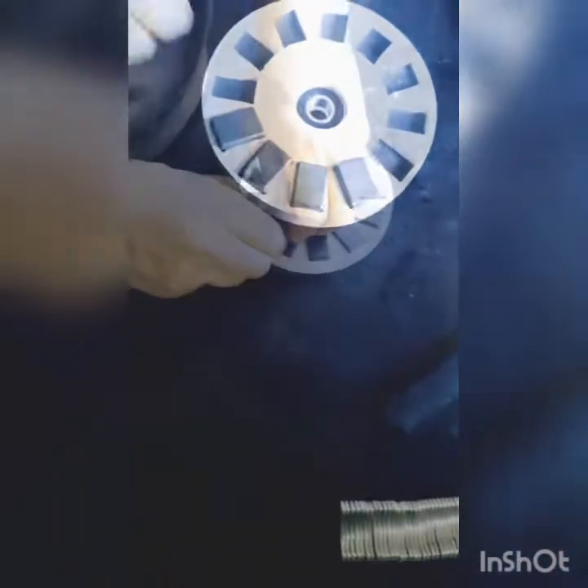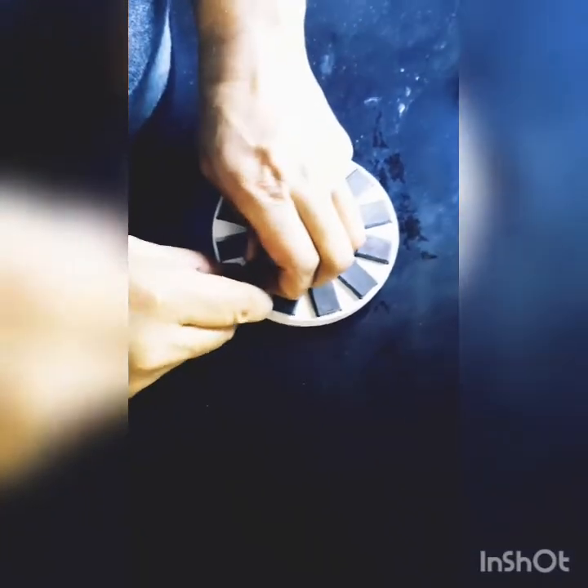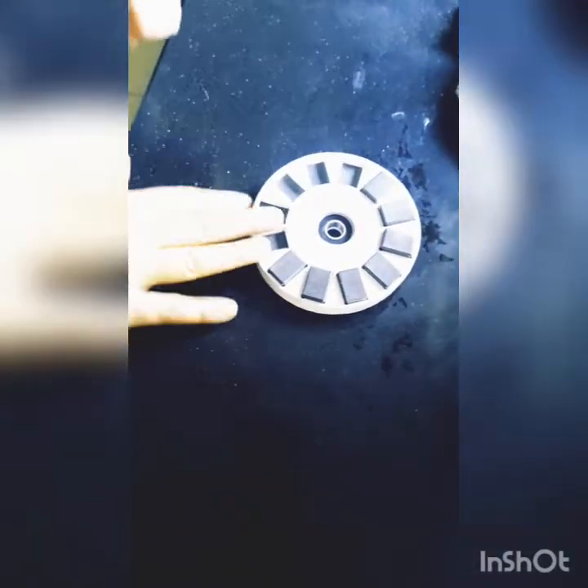We are almost there. Now we are on the other side — here there are magnets to fill in, just to add strength to our permanent magnets. Single magnets alone won't be strong enough to induce EMF in the coils, so I decided to double them in every slot.